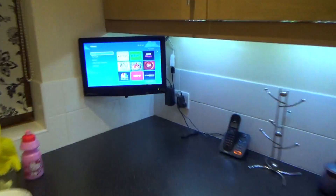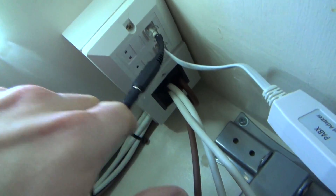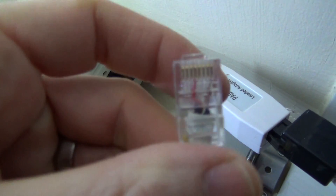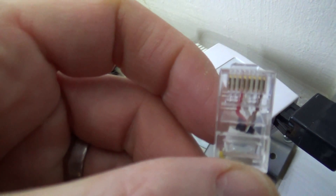And then we should have the same signal on every single TV in the house — so again, there, here, and here. As for the little IR receivers, they're on all the TVs — well, three of them — and they're these little things here that just stick on with sticky tape and go up to my little RJ45 socket here. The pins are mirrored — 4, 5, and the shielding on 8 — but as I say, I've already done a video on that so you can check that one out in more detail.